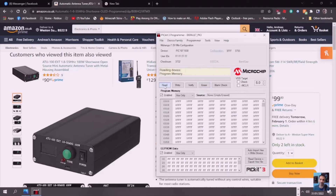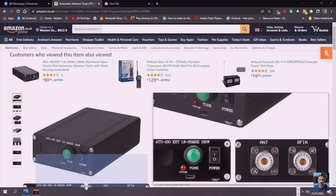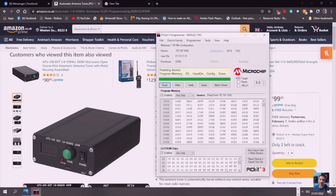Then read your radio and you'll get the values. There will be a slight difference on yours because I've already changed a figure. O1 here turns on the automatic tuner where you don't need to push the button — yours will say 0,0. If you want the automatic button, change it to 0,1. Then go along to 0,5 and change that to 0,1 as well.